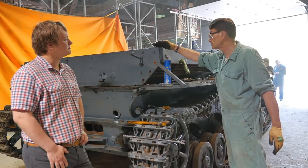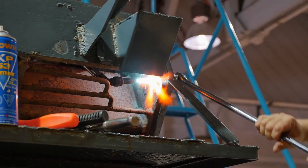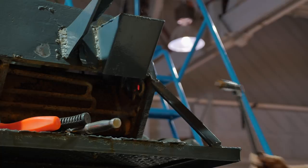The broken bolts will have to be drilled and re-tapped eventually, but we're having pretty good luck using the reliable old torches and penetrating oil — heating things up beforehand and loosening them up to pull out.